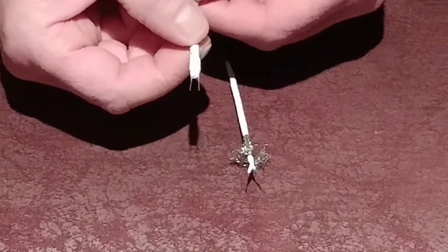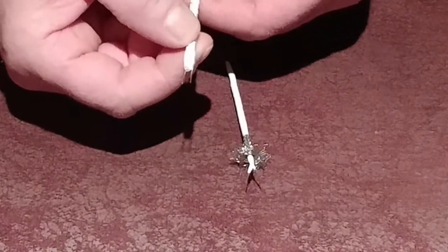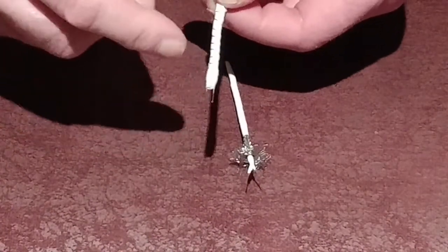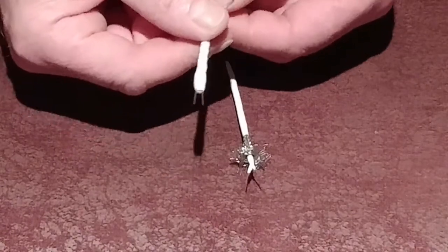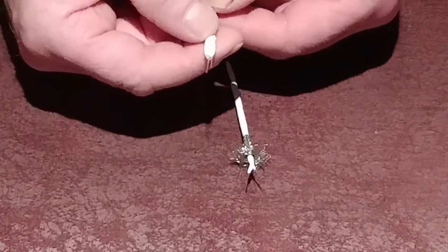This is the unshielded cable. We use a piece of paper piping cord in the center, then cover the piping cord in PTFE tape, wrap each conductor around the cable, and then use PTFE tape at both ends.